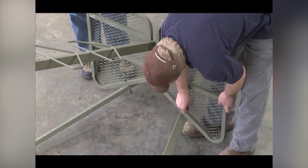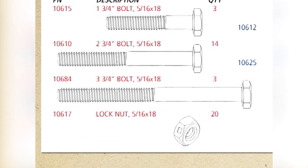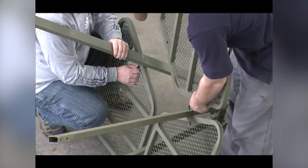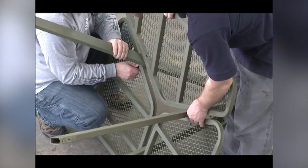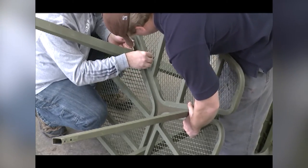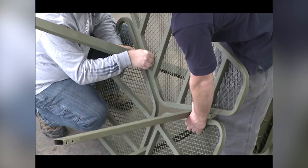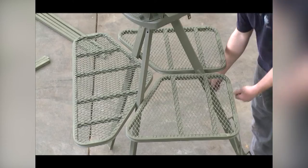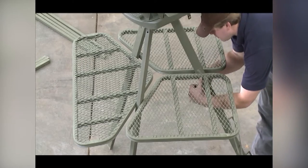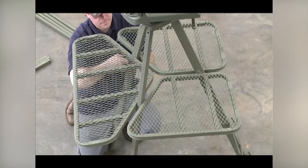Leave this hand tight for now. Insert a three-and-three-quarter-inch bolt through the other hole as shown. Position the rear platform section. The expanded metal should face up. Slide the platform section over both bolts inserted previously. Secure using two lock nuts. Go back and wrench tighten all bolts. As you tighten the bolts, the platform sections will pull together.